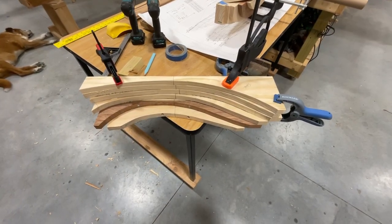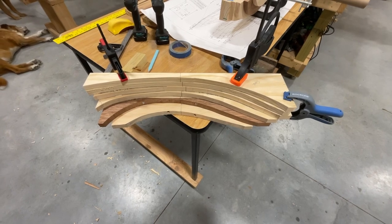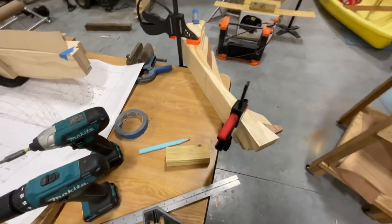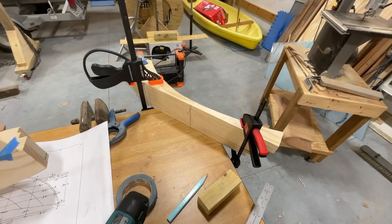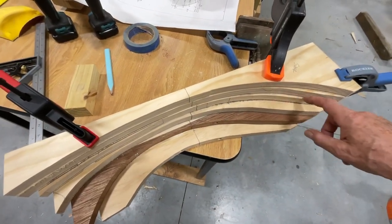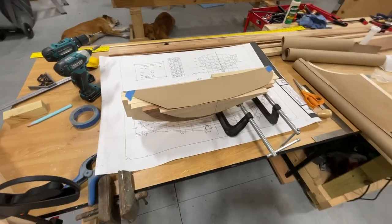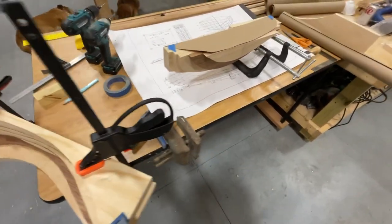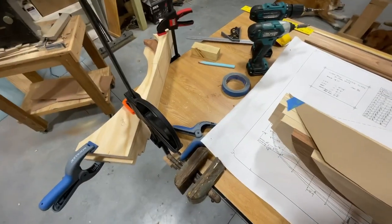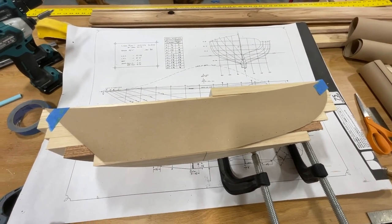All right, so now I took all my other pieces that I'd cut out and I've glued those together. Those lines there, the pencil marks, those are not appropriate. I actually made a better mark. I put the whole thing in there and made sure that it was sitting on there right. I got a straight line on the back so I knew roughly where they went. I took each one and I traced inside here for each successive lift. And so the thinking is that I should be able to put this in this so that when we draw the profile on here, we should be able to take it to the bandsaw and have a flat bottom surface so that we can cut this out without having it wiggling, wobbling all over the place, hopefully.